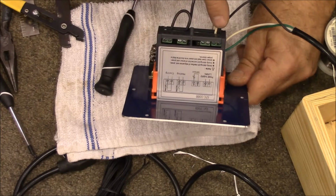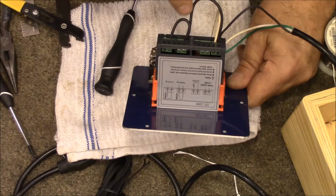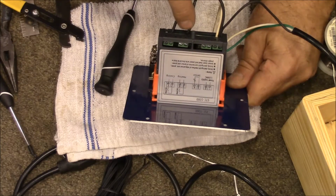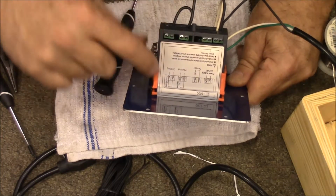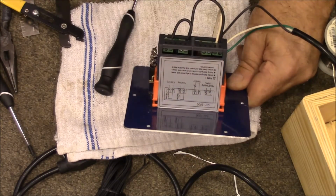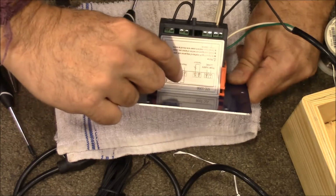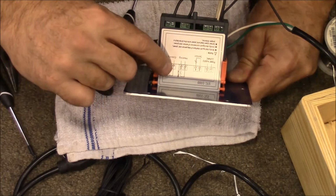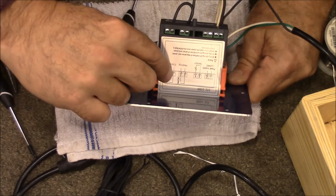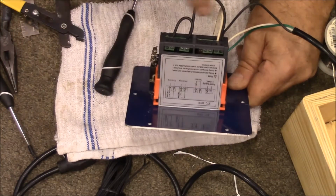And then we need that power to also power either our heater or our cooler. So another wire comes out of there and comes over to the relay for heating. And then we've done another jumper from that same spot over to number 7 to power the cooling side. Okay? Because what will happen is when this thermostat trips, whatever power you're providing in number 5, it'll send to number 6 if it's trying to heat something up, and whatever power you apply to terminal 7, it will send to terminal 8 if it's trying to cool. Okay, so we've got our power linked to those.